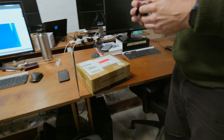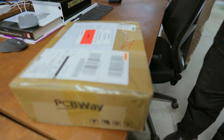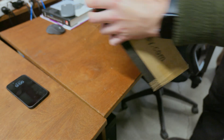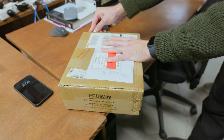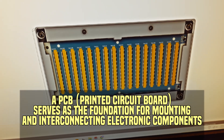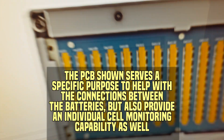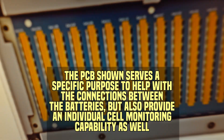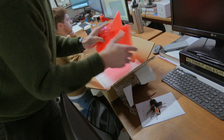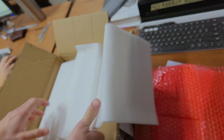We've got our test PCBs for the laser welder. They're designed to let us verify whether the laser welder will be able to successfully join the cell tabs. The whole concept is that we can use these PCBs in lots of different ways to test solderability, wire traces, and laser welding, given what we think will be the copper thickness.